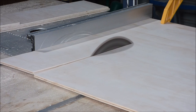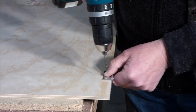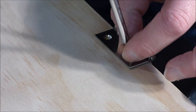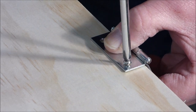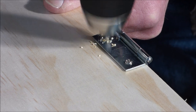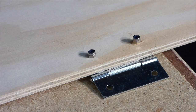I'm cutting one of the doors now. I started to put the hinges on using an interesting process I've used for quite some years: I drill through and get a metal screw — not a wood screw — and screw it directly into the wood so it makes its own thread, which is quite firm. Then I turn it over and put stainless steel lock nuts on as well. It's not suitable for a kitchen cabinet, but in the workshop it's a system that works very well.